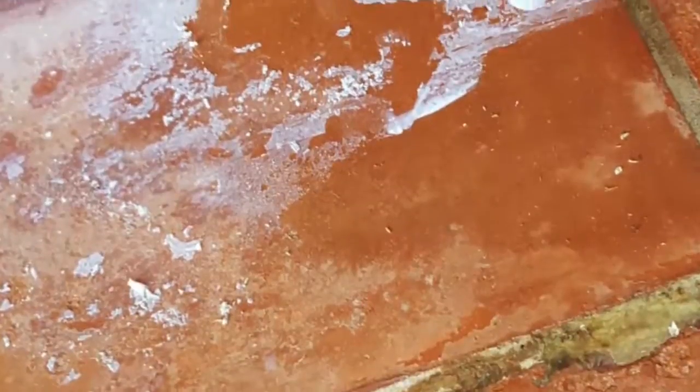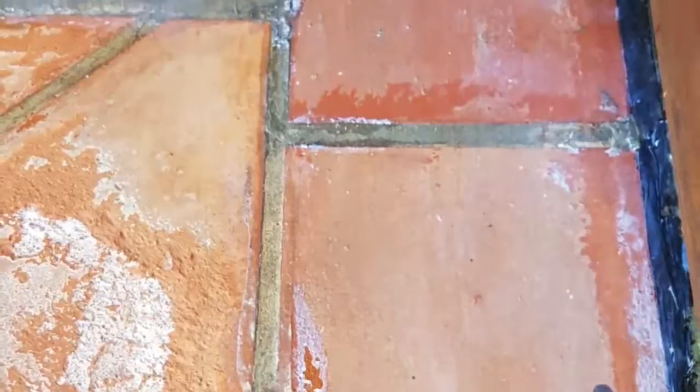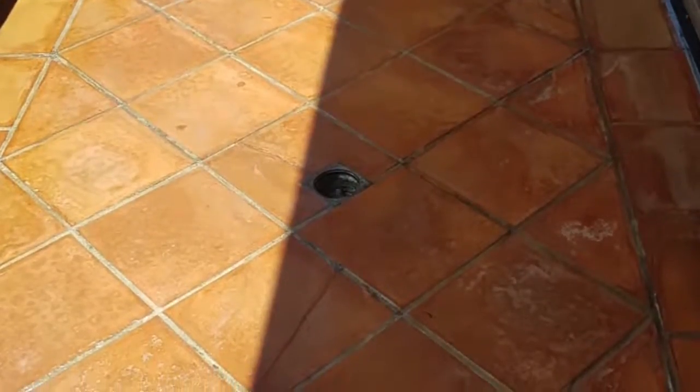Make sure the cleaning agent is thoroughly removed from the surface as it will react with the membrane and turn it white. If this occurs, remove the affected membrane, wipe the surface with a clean dampened sponge and ensure the surface dries before reapplication of the membrane to avoid condensation bubbles.